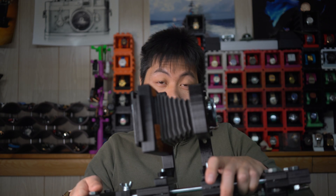When I was designing this thing, I noticed that camera bellows are not cheap. So in order to find one, I looked within my own collection for a sacrifice. I have plenty of Polaroid Land series cameras, and I thought — that film format is about 85mm by 108mm, or 3.25 by 4.25 inches. So, bigger than 6x9 and smaller than 4x5 — that'll do for my purposes. So I took one of these Land cameras and basically removed the bellows.